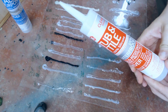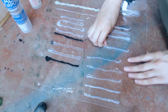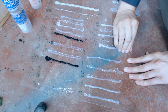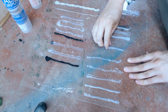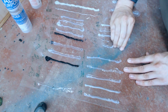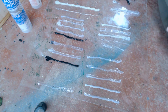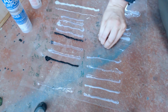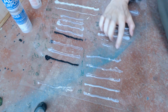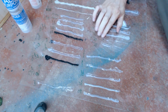GE Tub and Tile. On the smooth surface it came off even easier than the Silicone 1. On the scratches, it holds significantly better — I'm having a lot of difficulty pulling this off. So because this is formulated to be able to stick to plastic tub linings, you can see there's a lot more here that didn't come off easily versus the Silicone 1.